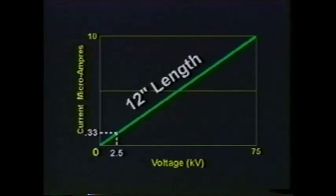The wet test is similar to the dry test, except that the full-scale value is 75 kV instead of 100 kV. Calculating the same correcting values, we get a correcting factor of 30 for the voltage correction and the same factor of 1/2 for the length, resulting in an actual amplification factor of 15.